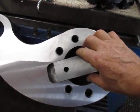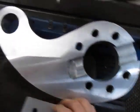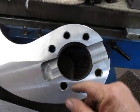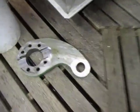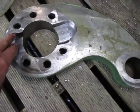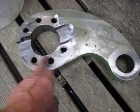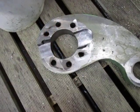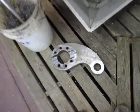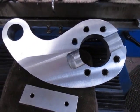That was brought to us first to do. We made that the other day and then they found the bludgeoning of the other one, which was this one here with the very badly damaged keys in it. They also attacked it with a gas axe, and the holes were all elongated from broken bolts and so forth. So we got a billet made and we went ahead and machined this out and did it.